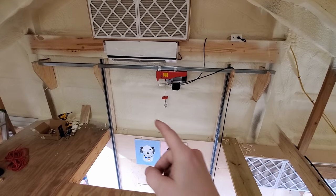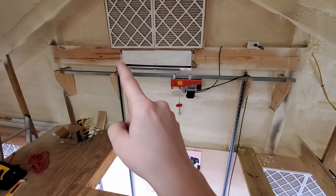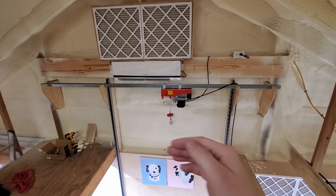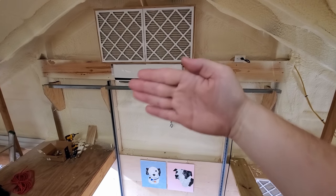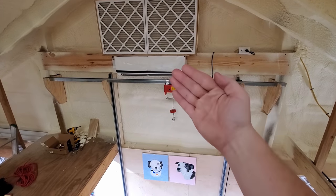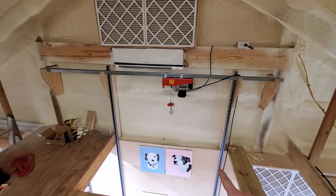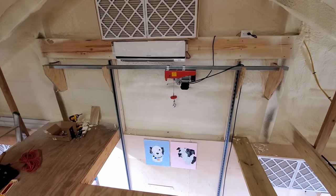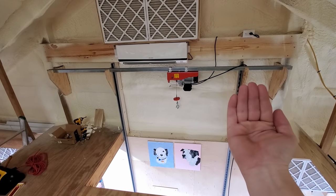The inner two brackets are secured to some studs that I added to support the vertical super strut. These studs are secured to the top plate down here on both sides. On this side, it's also secured to the joists of the loft. And they are both secured to this board that I already had up here for the mini split. So a lot of secure attachment points. My biggest concern was this piece right here flexing as the force is being applied, because it's going to pull it this way. But I don't think it's going to be much at all, especially considering that these vertical pieces of super strut are ten feet long — about four feet up here and then six feet on the wall below it. In order for this to flex out, that piece of super strut has to bend as well. I just don't see that being an issue at all.